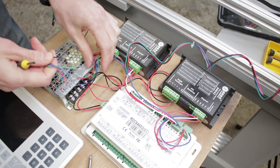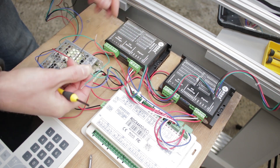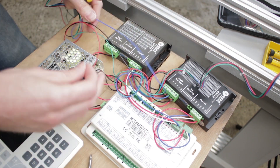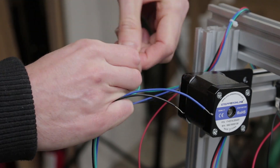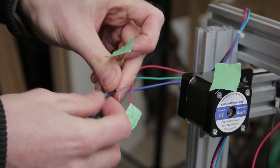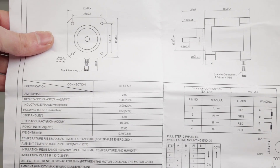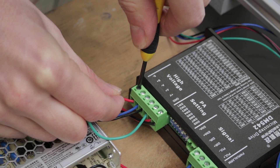Now I can wire in the stepper motors to the drivers. I'm using two stepper motors on my Y-axis, so I'm wiring them in mirrored parallel to each other, which is a fancy way of saying I'm sticking the opposite colours together so they spin different ways. The motor on the X-axis needs some extension wires attached — this is just temporary while I get the layout and testing sorted, so I don't want to waste time soldering at this stage. Different brand stepper drivers often have different coloured wires; hopefully they came with a wiring diagram, but if not, the wires work in pairs and are fairly straightforward to figure out with a bit of trial and error.